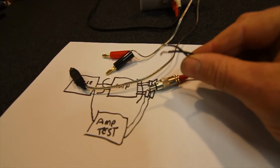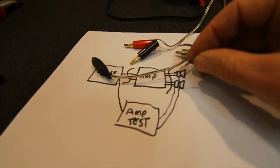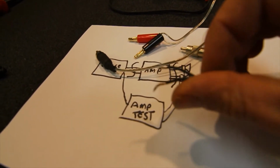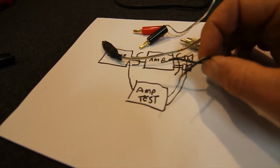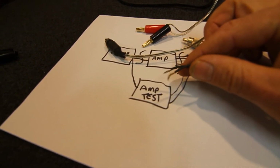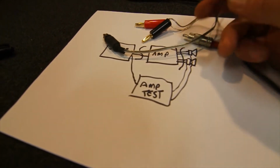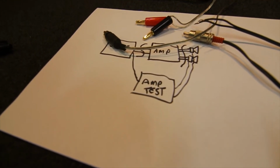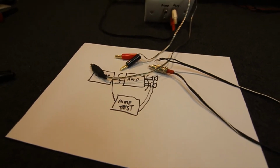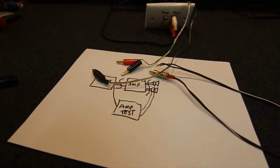But with the spring terminals, just use these. If you've got a car radio, you can just put a couple of clip leads on these or twist the wires onto the back of the stereo wiring harness. You just have to be a lot more careful that they don't start moving together and short out while you're running them. Either put tape around them or just keep a good eye on them, make sure they don't move. But you can basically hook up pretty much all modern equipment with that, both speakers or amplifiers.